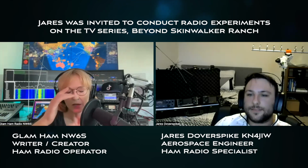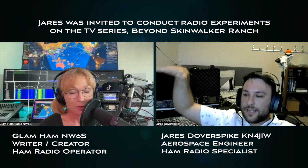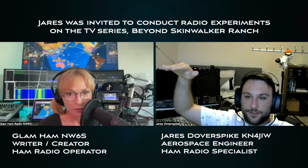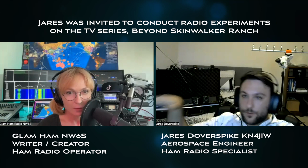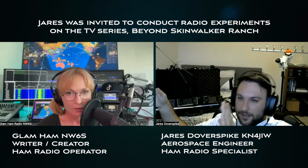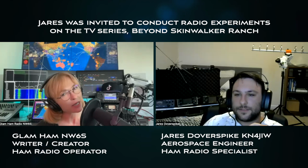The placements, yeah. So you don't normally receive on them. If you're transmitting on 100, you're not going to see anything on 50, or on 33, or on 20. You're only going to get power up from that. So if you want to transmit up to 1.6 gigahertz, you can use lower, but you can't say, I want to transmit at 1.6, I'm going to use 3.2. Got it. So you can't have downward harmonics.